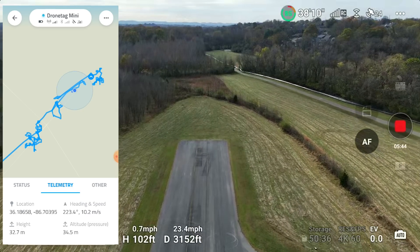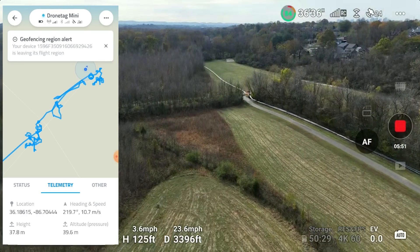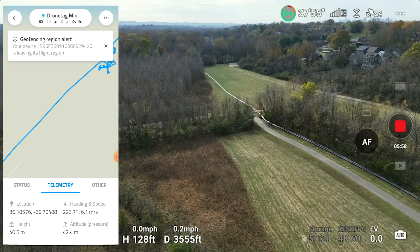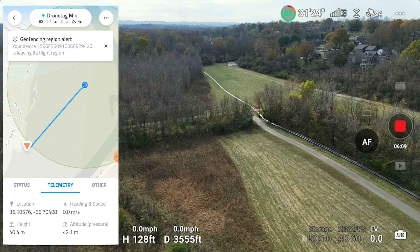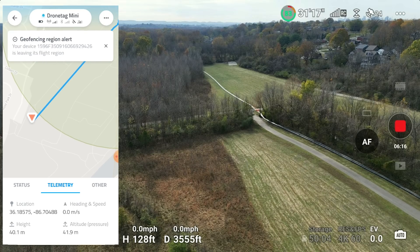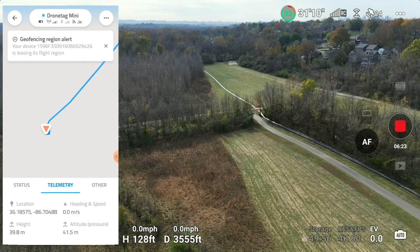Typically Bluetooth doesn't have that great a range — how did you manage to overcome that? People are always used to point-to-point communication — Bluetooth mouse, Bluetooth headphones — always working on like five meters. When you go to the next room, it gets lost. But when you're just listening to the broadcast, not sending something back from the phone, you can get into some pretty impressive range. With our device, we've tested over two miles from drone to smartphone just listening to broadcasts. The device uses just six milliwatts of power to radiate the surroundings.